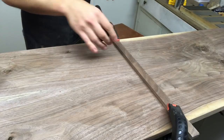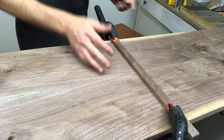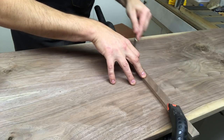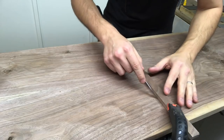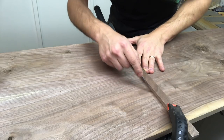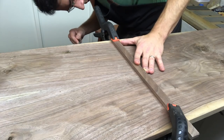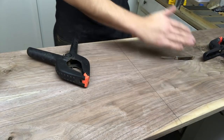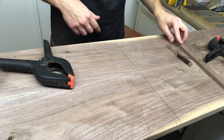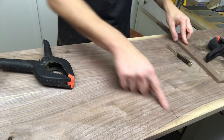I'm going to be putting a cross brace here that will be mortised into the front and back rails. I've got it positioned and clamped over exactly where I want it. I marked the center underneath and the center line here and lined them up. Now I'm just going to mark with my marking knife — each pass I'm pushing a little bit more, the first pass is really quite light. It just shifted — I felt it. There we go. As you can see, I've got a center line that fits right on that center line — the piece should go right like that. That's a great fit.